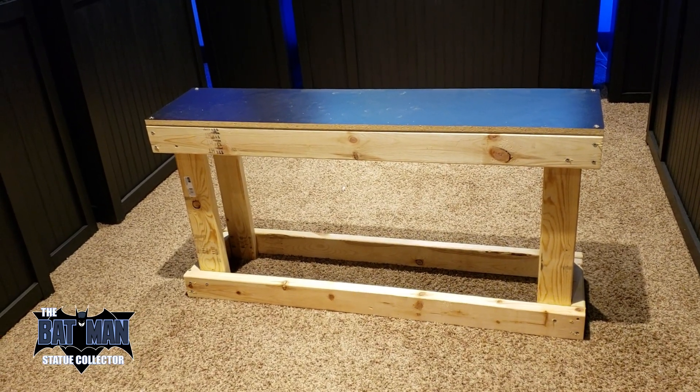If you've never made a shelf like this before, basically what you do is you make an outline frame here with whatever measurements you have, and I just screwed them in — really sloppy, doesn't look good, because mine's going to be covered. I made a frame like this, then did the exact same thing up top with a second frame, and screwed in my vertical pieces. Then I took the whole top piece, lowered it right into this frame, and screwed it in here and on the side. I put two screws in everything to give it extra support. It's incredibly durable and can withstand quite a bit of weight. Then I took that composite piece, drilled straight down into it, and it gives me that finished look.